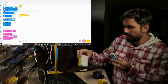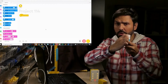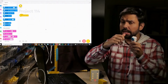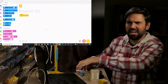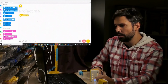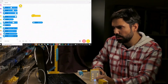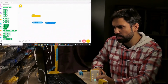And the exercise is, I will have 2 motors. One will be my input, so I'm not using it as a motor, just an encoder. And the other one is the motor that I will test. So I will move this one, and I want the other motor to copy this movement. So I will create a PID control. But here I'm not creating the full PID, just the P, just the proportional. To do that, we go to relative position. That's what I'm going to use. I will calculate the delta between them, so the difference between them.